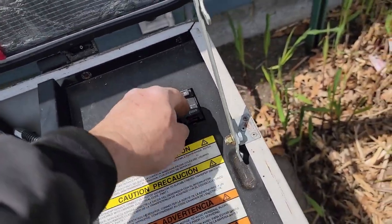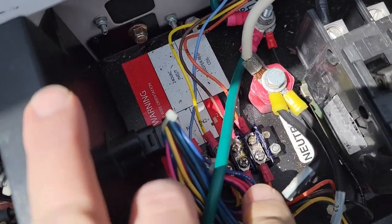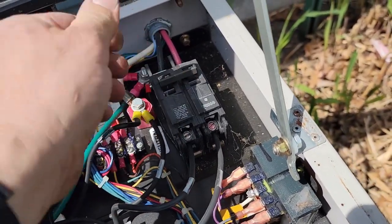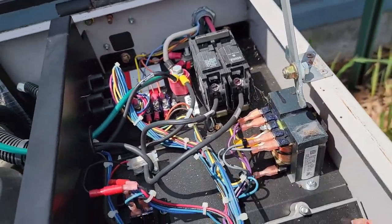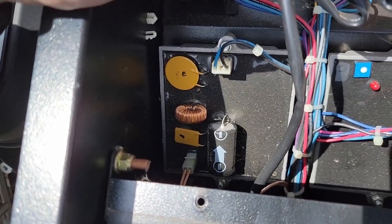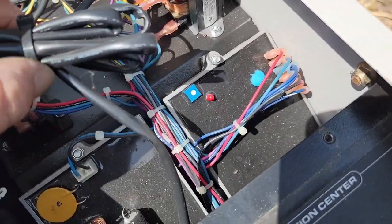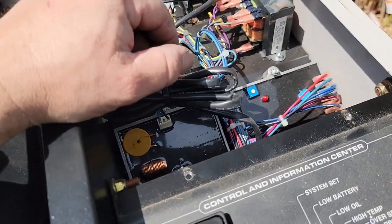We'll take this cover off - there is live voltage in here, 230 volts. Don't do this if you don't know what you're doing. You've got your input voltage coming in on L1 and L2 - that's where it senses voltage. You have a transfer coil there on terminals 23 and 194 - that's 12 volts DC going to the transfer switch to make it kick over. You've got your breaker here protecting the voltage going to the house. You've got your dual-tap transformer for the battery charge circuit - it takes 230 volts from the house and turns it into about 18 volts for the battery charger. When the generator is running it uses the other windings. They got rid of all that because they found out it's kind of dumb.